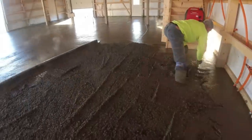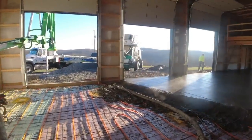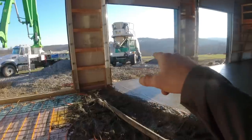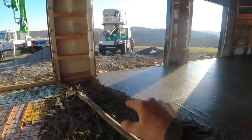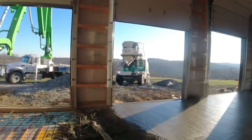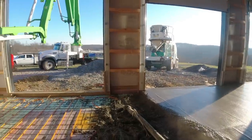Okay, pull this back. Waiting on number 5. I just missed it. Joe was blowing out the water lines in this cold weather, just driving down the road. The hose will freeze, the fittings will freeze, and then next load of concrete, you're all jammed up. So they blow all that out and get on the road. It's warming up nice.